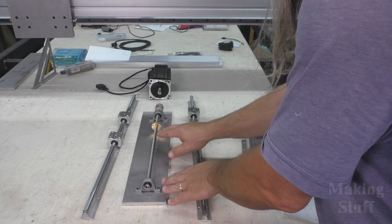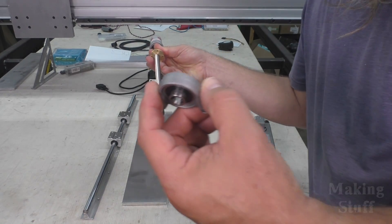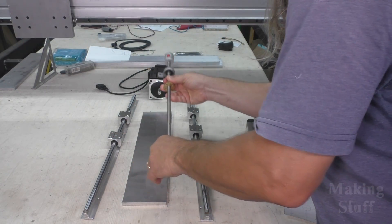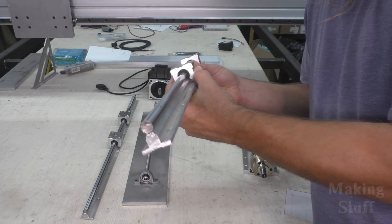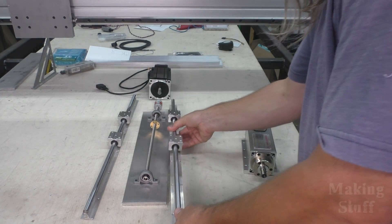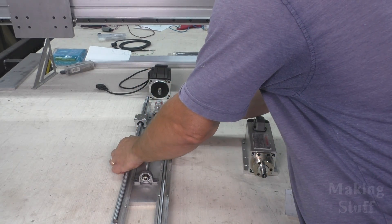To start out I've got a piece of four and a quarter by three-eighths aluminum. That's going to be the main base plate for my z-axis, and I've got these 10 millimeter pillow blocks and a 10 millimeter t-nut in this coupler. I'm going to mount those to the plate and then reuse these linear rails — the ones from the nail gun robot — so this will be the third time I've used these. I'm going to cut them to size so they fit between the two pillow blocks and mount on the side of the plate.